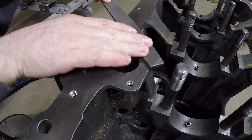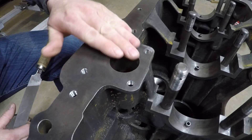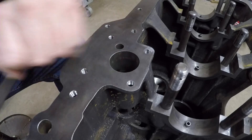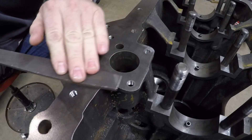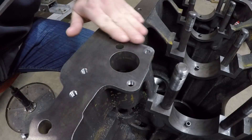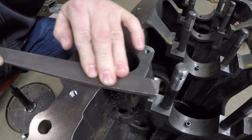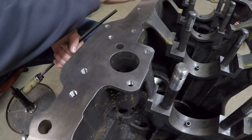Attack it from another angle — we've got that one pretty well flattened out. Moving on to the one next to it. You can really see where the high spot is where that top thread started to pull — that's just something that happens from years of bolt tension. There have been a lot of heating and cooling cycles applied to this material as well, which also contributes to that. Still feeling a little bit of drag as I go over that — there, it's pretty much diminished now.